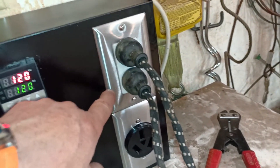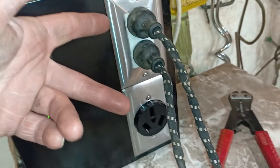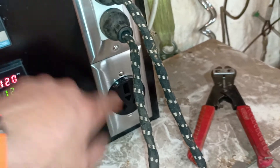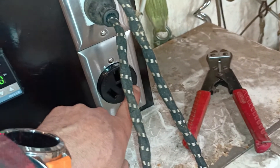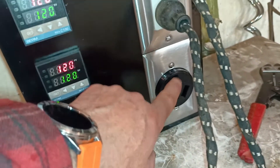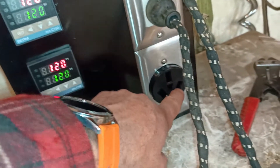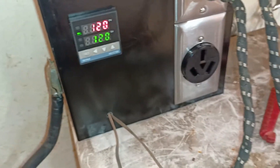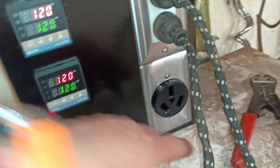So I can operate them independently through the power I feed through it. These controllers are split between the top and the bottom. It's actually 220 here — 110 to ground on one, 110 to ground on the other, but on opposite sides. So you've got 220 across the two of them and 110 from each to ground. They're switched independently of each other, so they're not necessarily on at the same time.